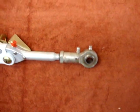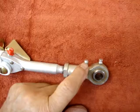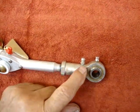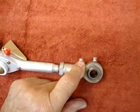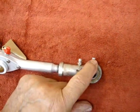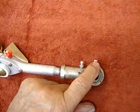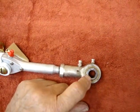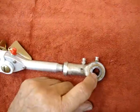By the way, these little grease fittings here on this rod end bearing — this is a vent. Because when you fill this with grease and assemble it, the grease has to have a volume to displace. This is an oil fitting, it's not a grease fitting. If you look in the service manual for that rod end bearing, it says mil dash L, which is oil. See ya.